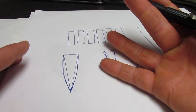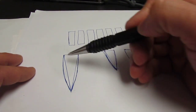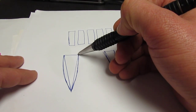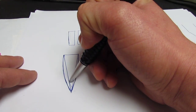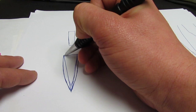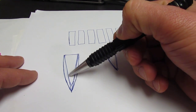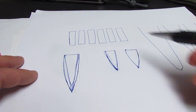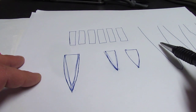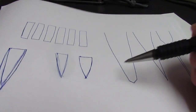I'm not saying I'm a genius or anything, but what I see immediately is, no matter how much you convex, because if you convex this full flat grind here, zero grind, flat, right? If you convex this, you're thickening up that edge. There's no way you could convex a zero flat ground blade unless you want to take off some of the top here and you want to take off your sharp edge here. Now, there's a reason people don't use zero ground flat grinds, zero flats. That reason is because they're just not strong.